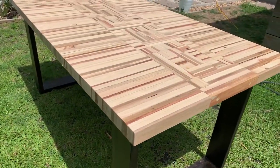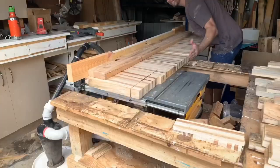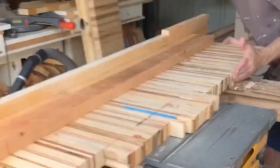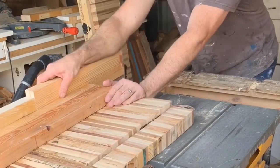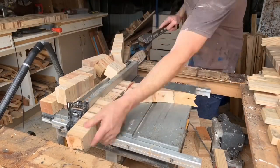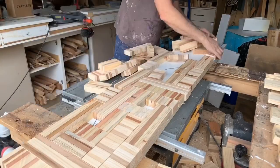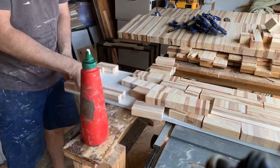G'day — in this build I'm going to build a six-seater dining table. It's going to have three panels up top with that crazy pattern running through the middle. In my table saw I'm now using it to cut these two outer panels so they're nice and parallel. I also recommend getting an outfeed table because the weight of this slab is going to want to tip over as you start to push it through the saw. Now I'll start work on the centre panel with that crazy pattern so it looks almost like a table runner. I'll lay all the bricks out on the MDF nice and random to make sure I've got enough, then start with the glue and clamps.